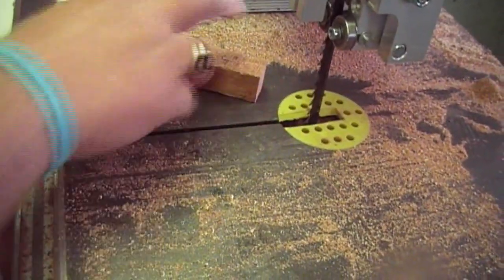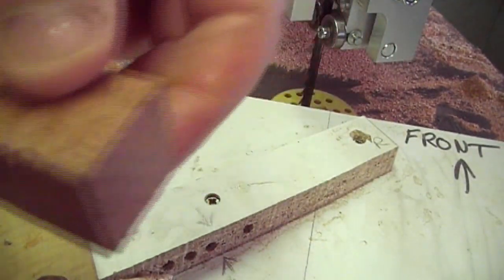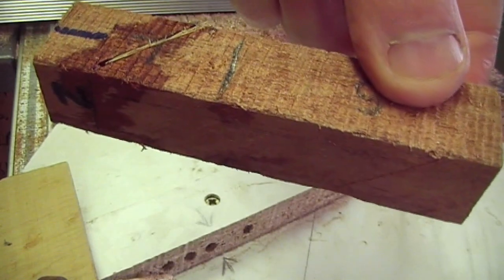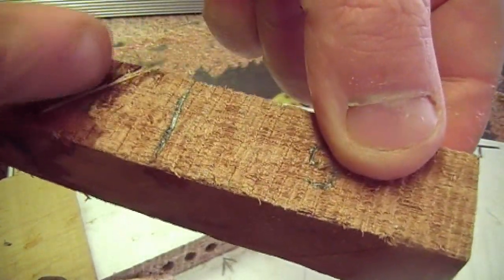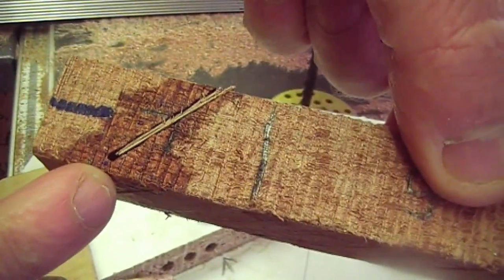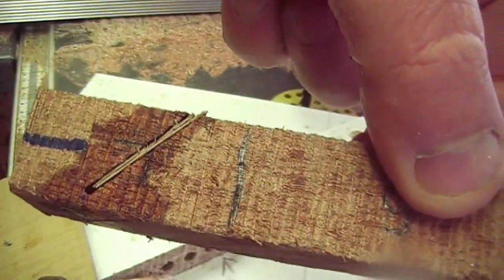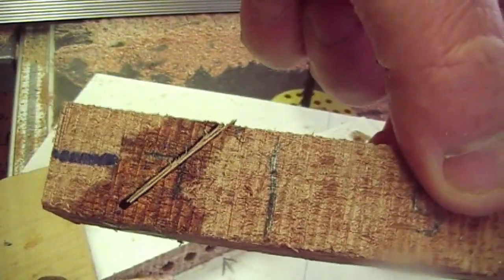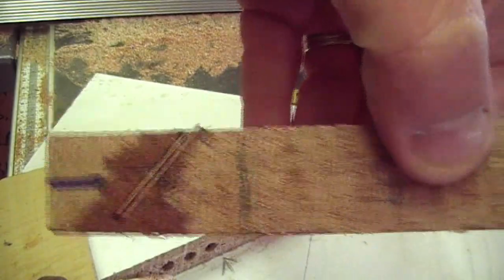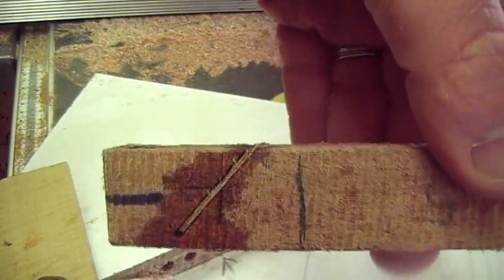The idea is, I've done one side already. You clamp it in on the angle, and run the jig up the side of the bandsaw until it hits the backstop, which forms this cut, which stops just fractionally before the edge, a couple of mil before the edge. You put in some veneer of a different colour, and clamp it with a clicky clamp after you've super glued it, obviously. Then you do all four sides, and you end up with a cross with a line at the bottom. And when you turn it, it forms a Celtic band.